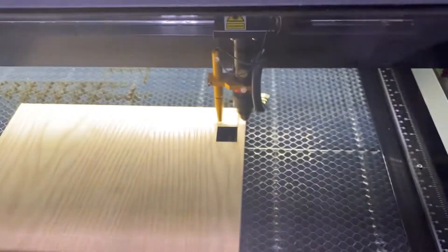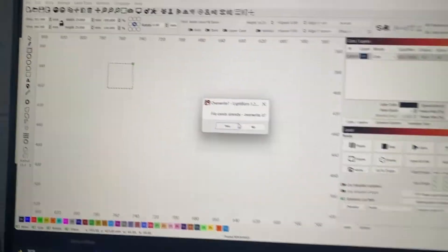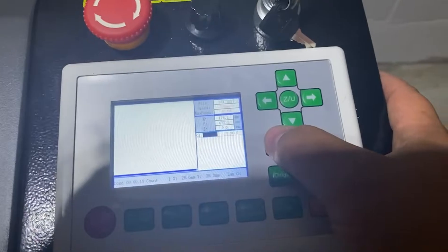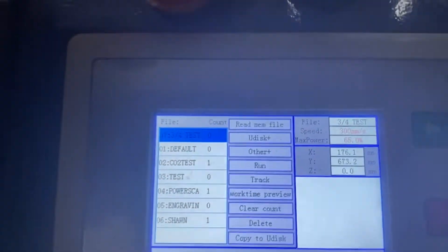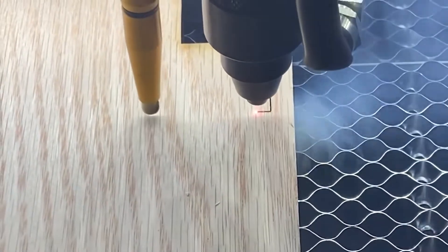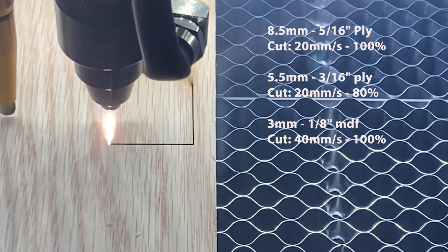This is me testing it on three-quarter-inch oak plywood. All you do is bring it down to where you want it to start and press Origin — that's very important. Then in LightBurn you need to make sure you start from User Origin, or else you'll have a whole bunch of headaches. Click Send — as long as it's plugged in that will send the file over to the laser. Hit Escape, then File, then it's usually the first one on the top — hit Enter. You can press Frame to see the boundary, then hit Go. This is about 5 mm per second at 100% power.